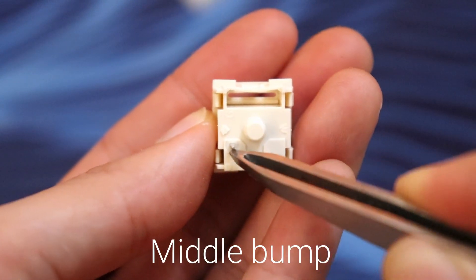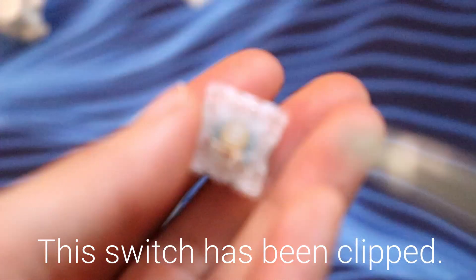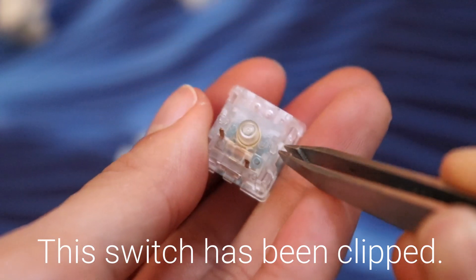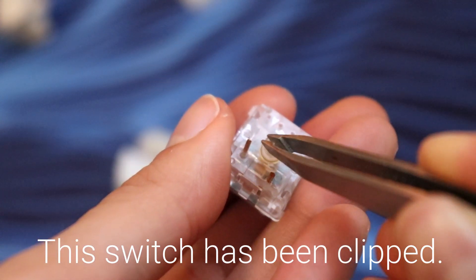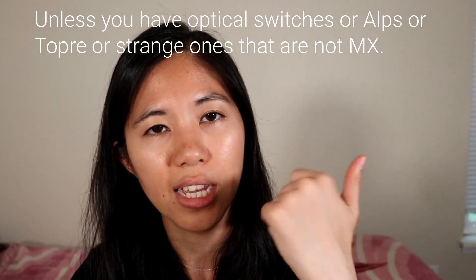So why would you want one over the other? It really doesn't matter. If you have a three pin hot swap board and a five pin switch, you can take either cuticle clippers or nail clippers and just clip those two plastic legs on the side off, and then you can use those switches with your three pin PCB. You don't really have to be concerned about the compatibility of switches when it comes to hot swappable boards, unless you really do not want to clip those legs off — then you would be a little bit limited in your choices of switches and of boards.